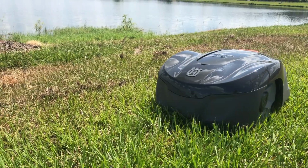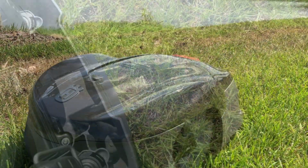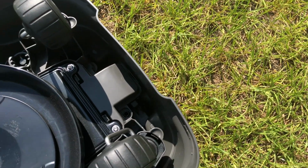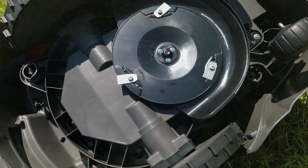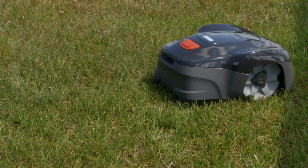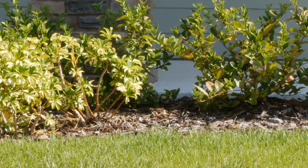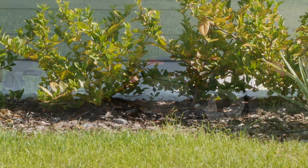When the mower is at work, it quietly runs around your yard with a little ticking sound as it cuts off the tips of the grass. For safety reasons, the cutting swath is not the entire width of the mower, leaving several inches between the edge and the blades. One big difference in comparing this mower to a traditional mower is the lack of suction. It means the 115H can roll over small sticks, leaves, and mulch without picking it up and dulling your blades.